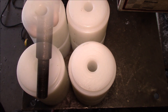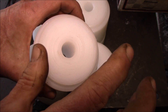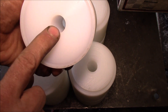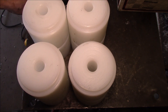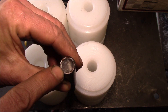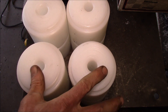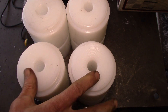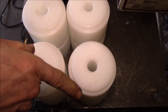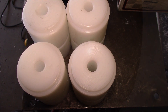I just thought I'd show you how these are made — they're one of our more complicated lift blocks because you have to machine the top, the sides, and the bottom. You have a step on one side, a recess on the other side, a very large center hole, and then you also have to build this metric bolt extension with 14mm male thread, female thread, and about an 18mm shank — it's a custom-built part. I've got to get this packed up and off to the customer today. If you have any questions about these body lift blocks, drop a comment below, and as always thanks for watching — we'll see you next time.